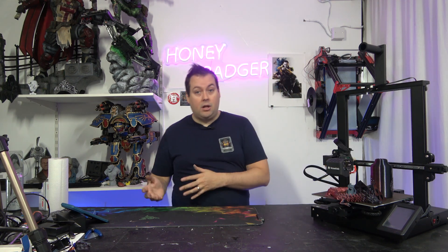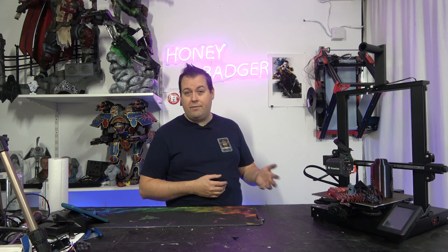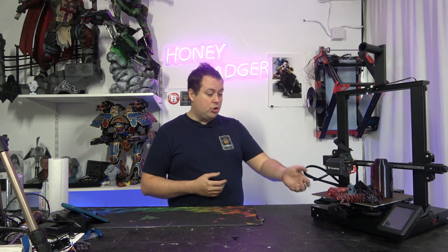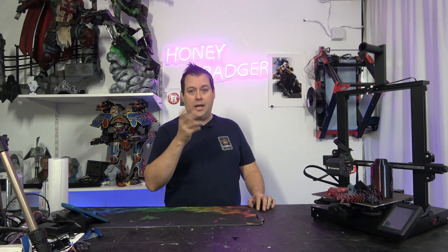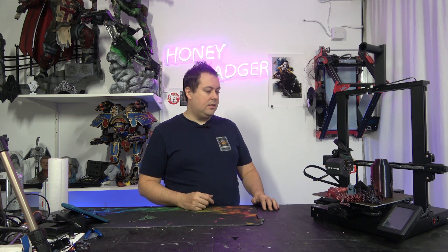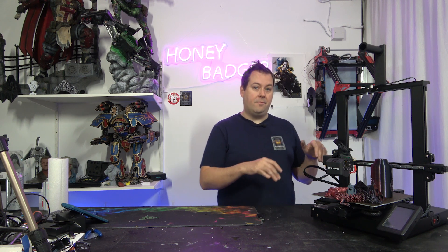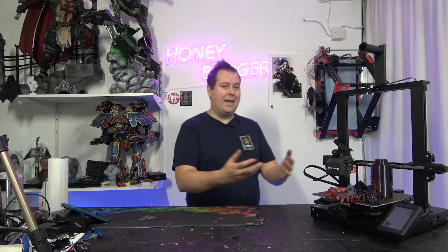It goes together very easily — we did a live stream on this. It's two or three bolts, the screen bolts on, and then you're pretty much good to go. The auto bed level works pretty well. We've got ours set to about minus 3.25 for the Z offset — it works really well, pretty easy to level the bed. You do still have levelling knobs, so you have to go around all four corners and level the build plate to the nozzle, then do the Z offset. It's a bit annoying that you have to do that — I would have liked to have seen the bed fixed in place from factory and just have the auto level create a mesh.